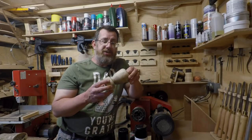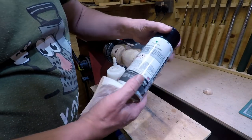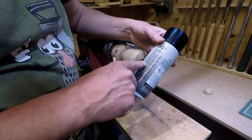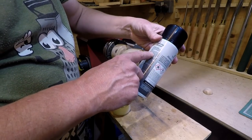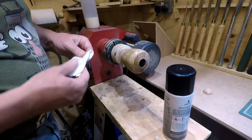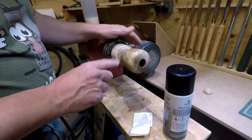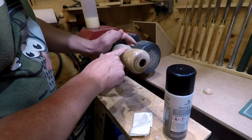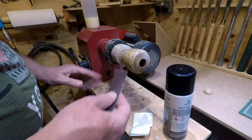I've sanded both down to 600 grit inside and out. The instructions for the ebonizer and lacquer say to first apply a coat of either acrylic or cellulose sanding sealer. I'm just going to let that dry — which shouldn't take too long because I do thin my sanding sealer down — and then give it a second coat and knock that back again with 600 paper.